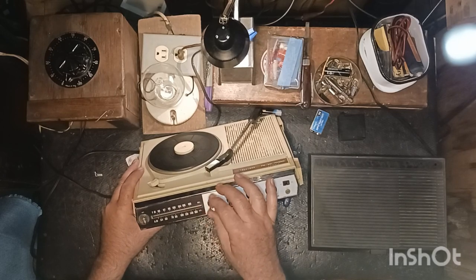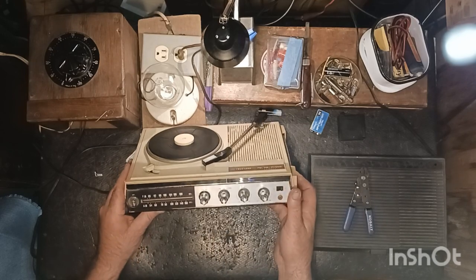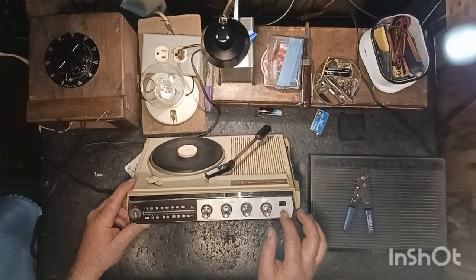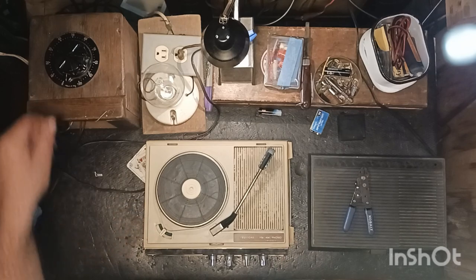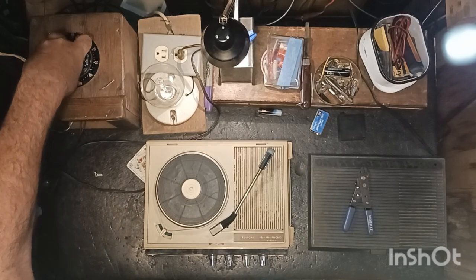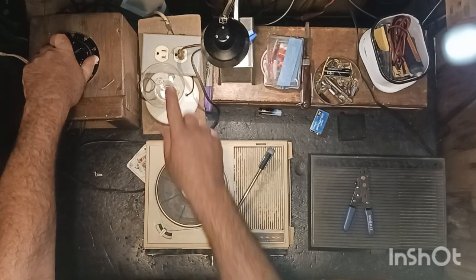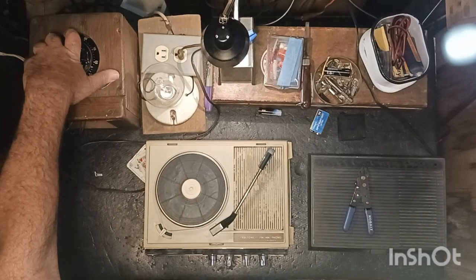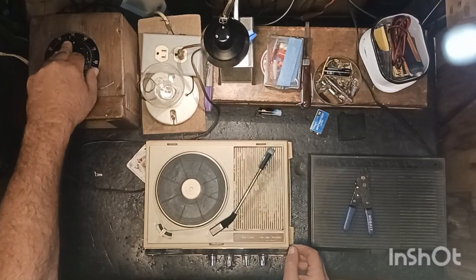I hear something in there, kind of rubbing. Maybe we can fix it if we can get the radio playing and everything. Let's give it some juice, guys. Let's turn it on. It's on. Let's crank her up a little bit here. Give her some voltage. So far, no shorts in our dim bulb. We're at about 60, or 50. We're up to 50.